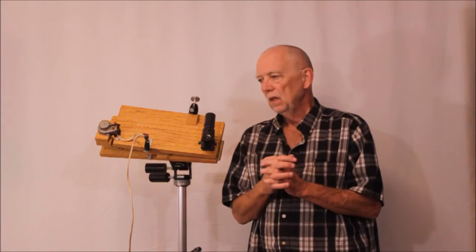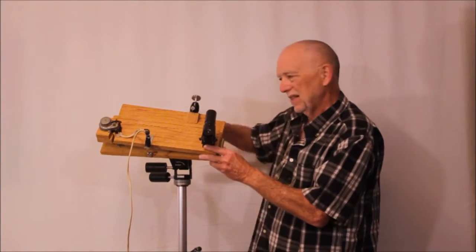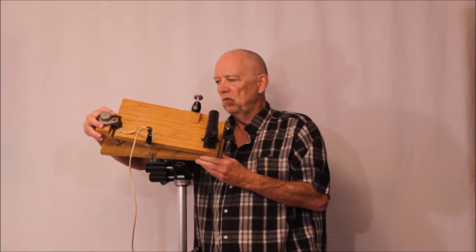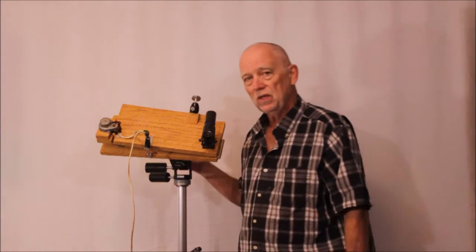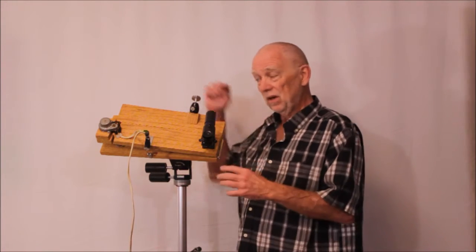This is my solution — what I invented back in the 1980s to do something on the cheap that was still reasonably accurate. It's called a double arm barn door drive. It's similar to a standard barn door drive in that the telescope rides on a hinged board, but unlike that one, this has what I call a driver board. The driver board and the rider board are at slightly different angles because the hinge is offset — there are two different hinges. So it's basically two barn door drives coupled together in a very special way, giving more precision. It eliminates the tangent error for up to 20 or even 45 minutes. It took many hours of work on a Commodore 64 to analyze the equations and figure out exactly how to make this.